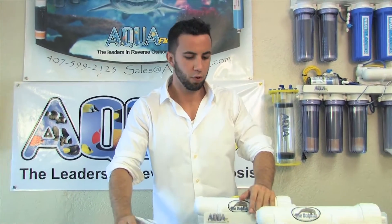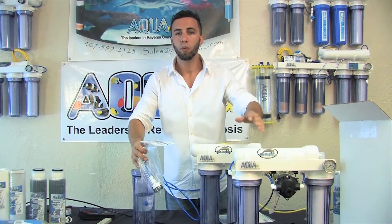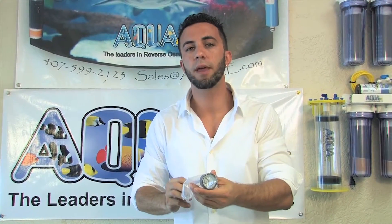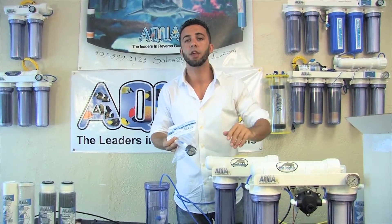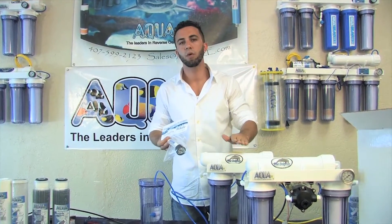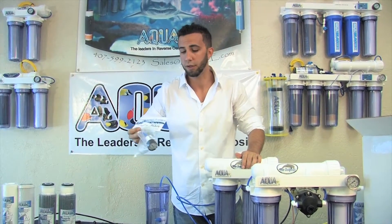You may be asking yourself which unit is more appropriate — the traditional Dolphin or the Dolphin with the booster pump mounted. What we'd like you to do is make the most appropriate selection. If you order a pressure gauge kit from us, we'll send you one in the mail and then give you a credit for it once you know which unit is needed for your application. We don't want you spending money unnecessarily or over-pressurizing the unit, but we also don't want you under-producing. I'd definitely recommend the pressure gauge kit just to see what pressure your household or facility is at.